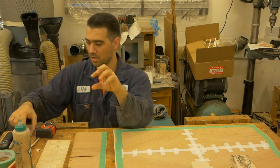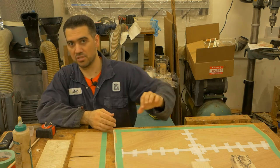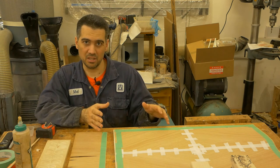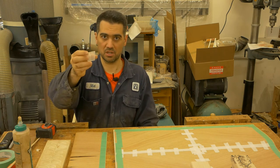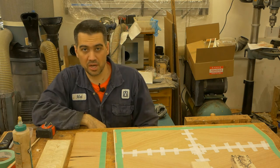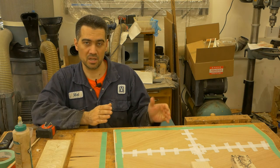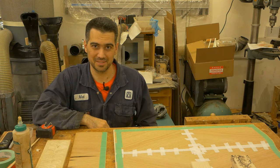For example, in my current project, which is 72 by 46 by 0.025 centimeters, it comes up to roughly 80 cubic centimeters. So I simply need 2 2/3 of this particular cup. So now that we know how to calculate the amount of glue, let's get gluing. The footage will be sped up, and the next time you see me talking is when we inspect the pattern for flatness. Let's get gluing.